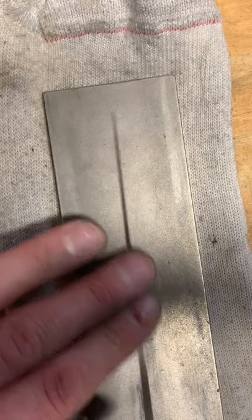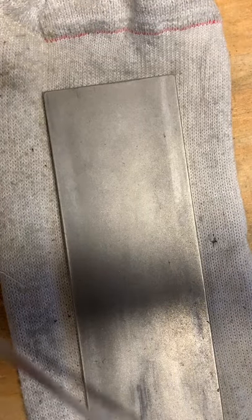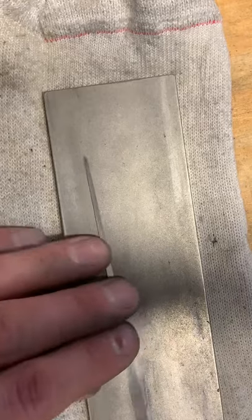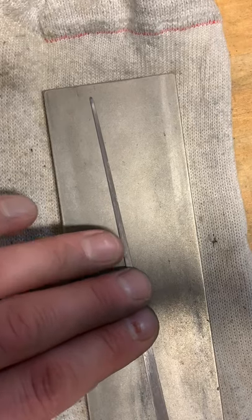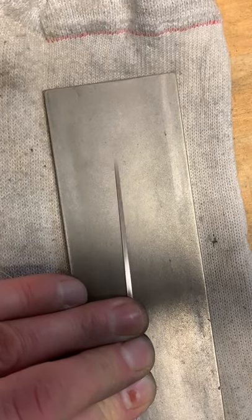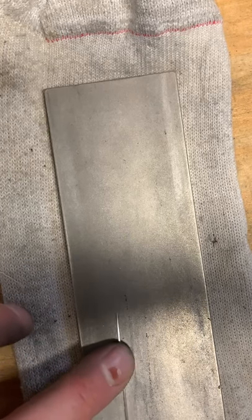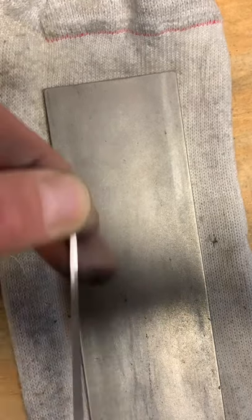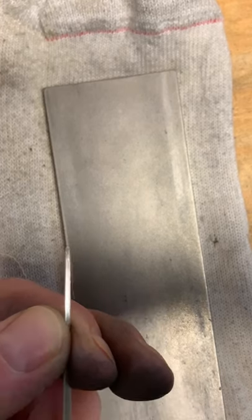I need to wash this plate - it's kind of starting to get a little clogged. That angle is completely blended in, this one needs a little bit more blending, a little more polishing. I'm going to come up to the edge and sometimes come clear over, do some work on the flat too. Polishing on the tip up near where the trigger bend will be - we want that to be completely polished, we want that to flow nicely. It feels super, super smooth, and even gripping with the edges that are at a very sharp angle, but the angle has been dulled and smooth.